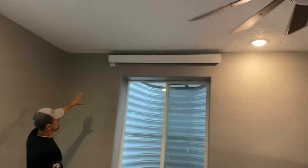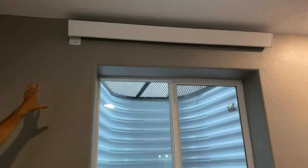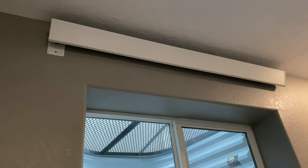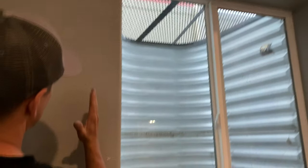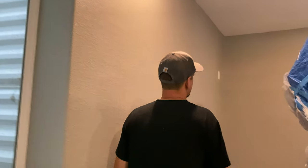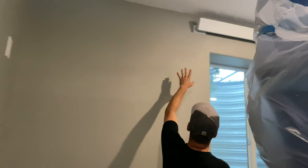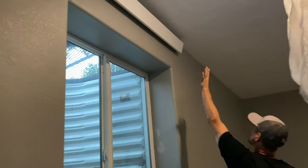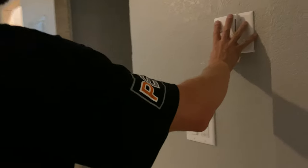Some of the stuff we did here is just general lighting. I do love this right here — this is a cove heater. These are designed to stay up high above a valance; it's real tricky to get them to mount in. I like how it trimmed out, but the way the studs turned out on this wall, it was a little more difficult. You can paint the cover to match the wall, but you cannot paint that valance up there. They're 750 watts for a five-footer, so I've got three of them at 2,250 watts on one 20-amp circuit. Your thermostats have to be at a different location.